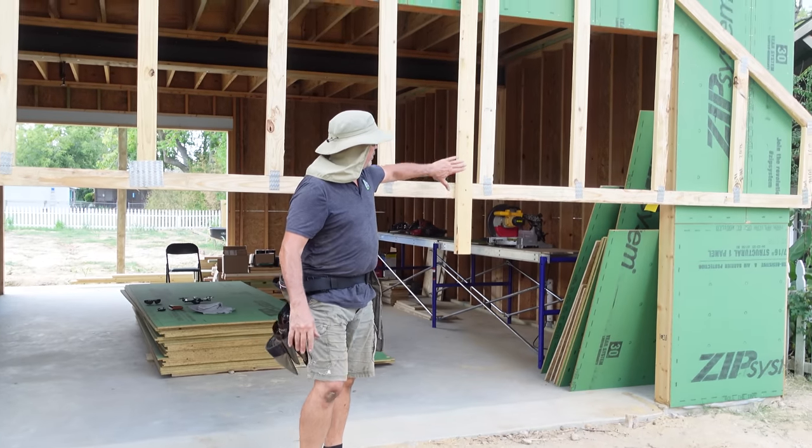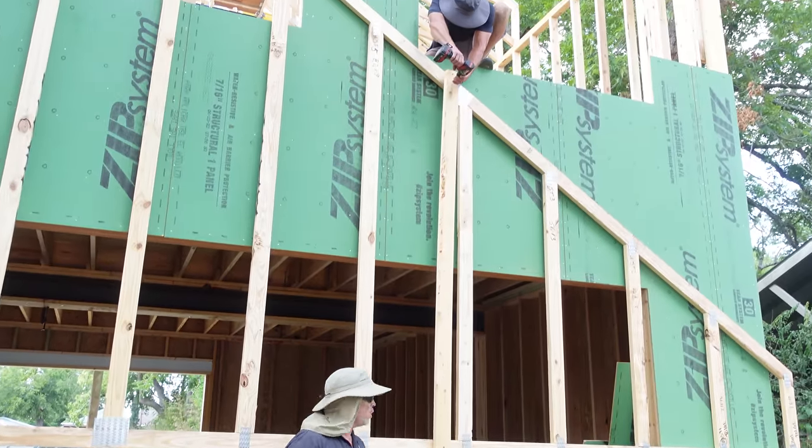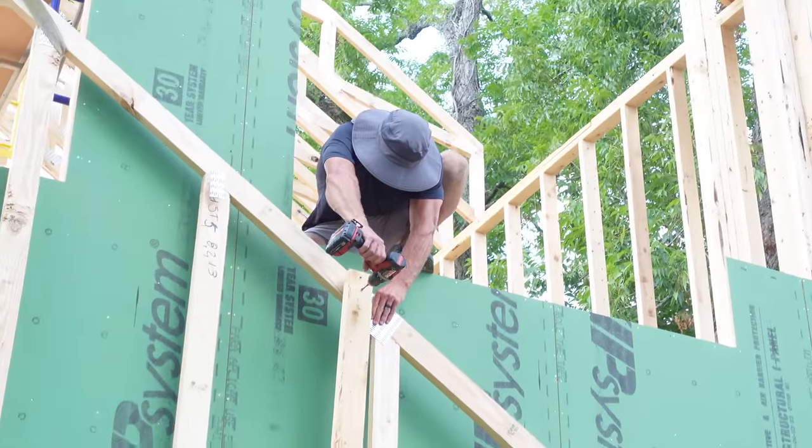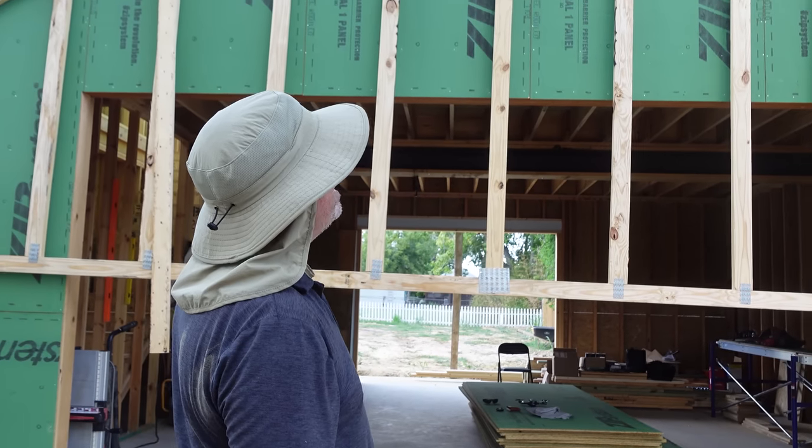All right, we decided to put these 2x4s on now, so when we lift the truss, it won't swing too far. This will go against the existing framing and make it flush to our wall. We just gotta position it this way, screw it down. You ready there, stuntman?